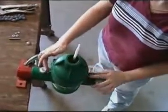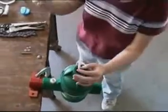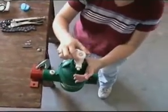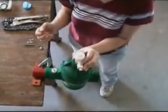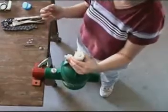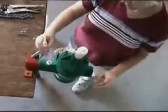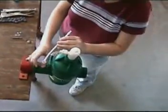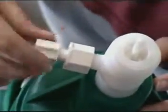Install the pump body into the motor bottom cap by aligning the wings on the body with the slot openings in the cap. Push the body in past the two O-rings, then turn 1/4 turn to lock in place. Install the pressure tube onto the motor body and pump body pressure fittings. Loosen the fitting cap. Push the tube into the fitting as far as it will go and then tighten the cap. Make sure that the tube is pushed far enough in to secure the connection.